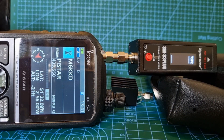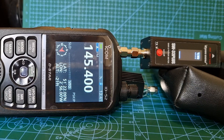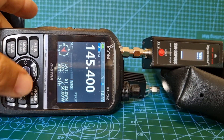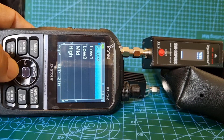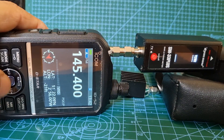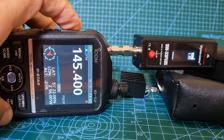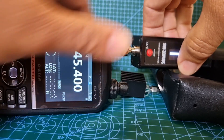So power-wise, let's go on to two meters. We'll just hold down DR like so, then we'll go to VFO. We're on 145.400. So this is the power change - let's hold it down and we'll go to high. Let's start high and push PTT with the antenna. It's gone to VSWR - it does say one to one, which it should do with the stock antenna.